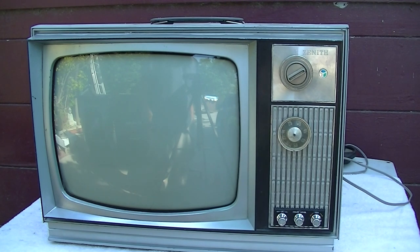I don't think it's anything major. I think maybe it's the thermistor on the input or something in the power supply. Like I say, I use it about an hour a week, and it lasted a couple years, and that's probably about what you would expect for something of this vintage. Again, made in 1970. We'll put the power meter on it, then we'll get the back off and have a look. With my luck, it'll probably just work.